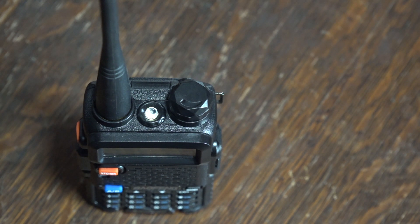With this modification, the volume knob still changes the volume. I've found that this is the best position for the audio. I recommend putting the volume knob at this level and then putting RTV silicone around the knob so that it prevents the knob from being bumped. The other option is to remove the knob entirely.